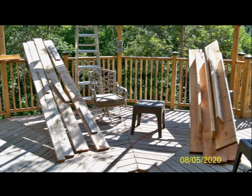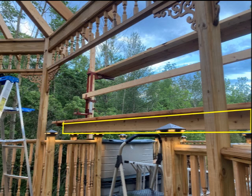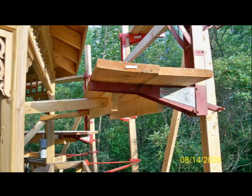Here's the lumber I used for the platforms. The bottom platform, what I stood on, was made of 2 9-foot-long 2x12s. The platform with the workbench was made up of 2 9-foot-long 2x8s and 1 2x6. Each of the pieces that made up the bottom platforms was stiffened with a 7-foot-long 2x6. Each of the 2 pieces that made up the bottom platform looked like T-beams when looked at straight on.